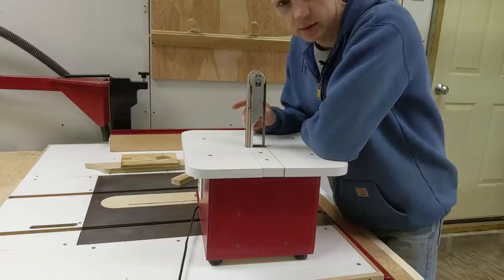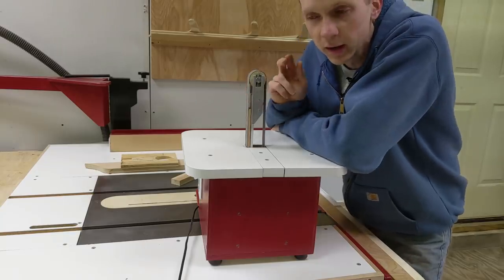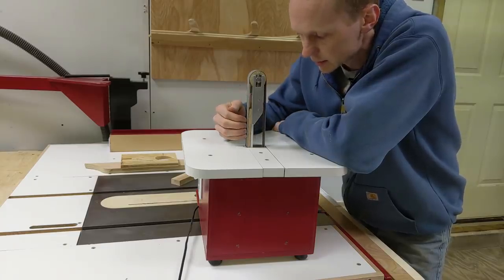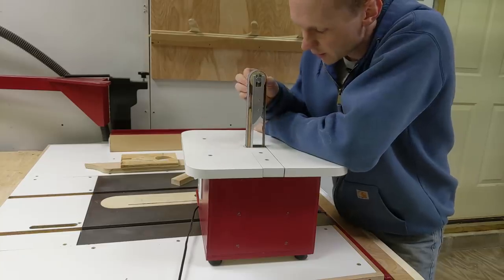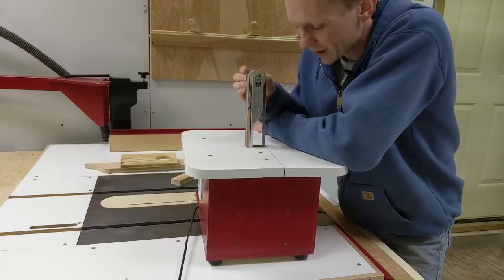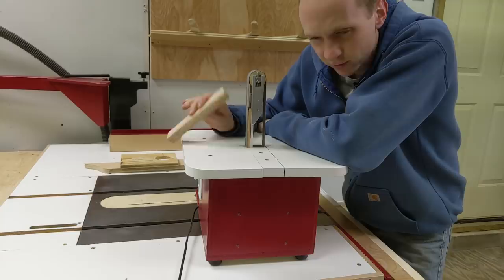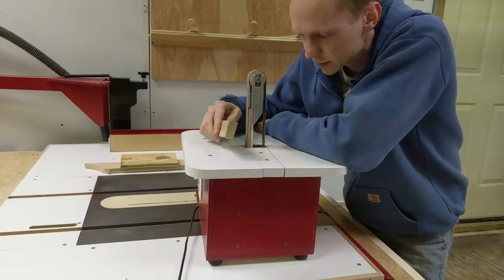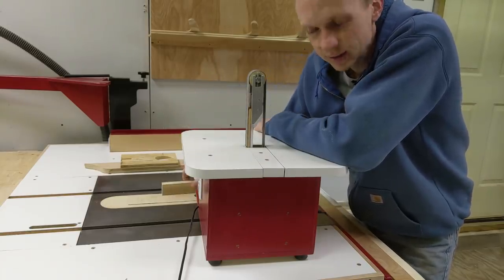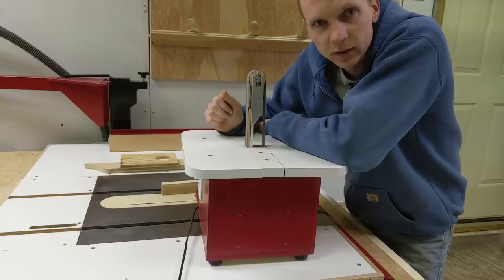Now there is one thing about this design that doesn't work very well and I want to fix that today: how I attach the sanding post to the main platform below. That was with a bottom screw and a top adjustment screw so I could perfectly align it to 90 degrees with the table. However it keeps loosening up over time and right now it's not holding its position — I can actually move the whole post back and forth. It's not really a big deal since I mostly use it for sanding smaller pieces and curves rather than squaring up to 90 degrees. So I'm just going to take this apart, glue the whole support in place, get it as close to 90 degrees as possible, and I think that'll be a good enough fix.